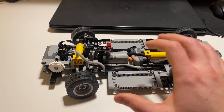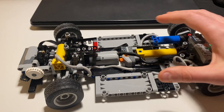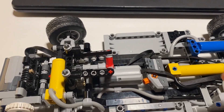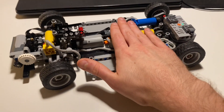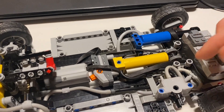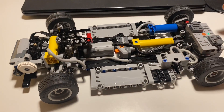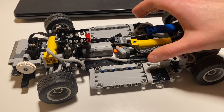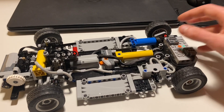Most of the effort in getting the chassis to its current state was actually not the piston engine, but all of the cable management and maximizing space given all of the systems present. I routed the electrical cables to the battery in the most compact way possible — everything is really flat here. The pneumatic systems are also routed into tight little bundles carefully along the chassis to maximize interior space. All of this area is where the center console will be; where it gets wider is where the rear seats will be; and the battery is mounted in the trunk.